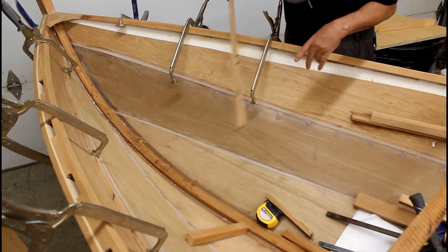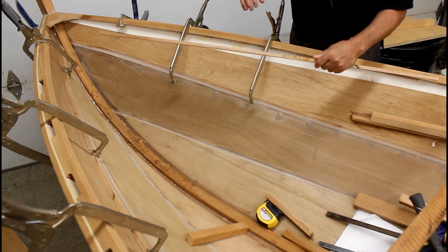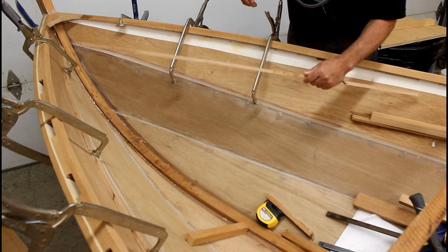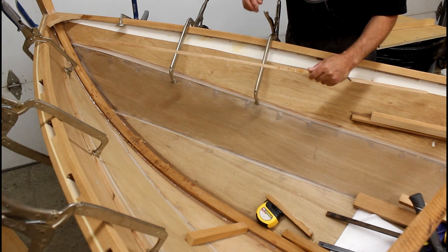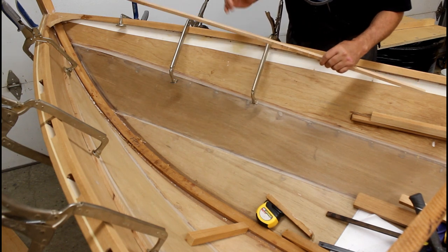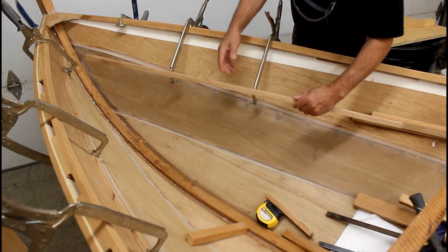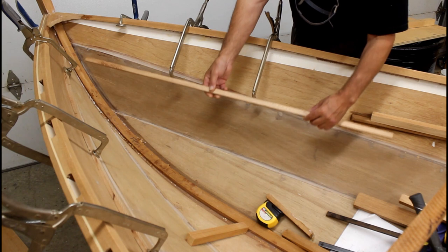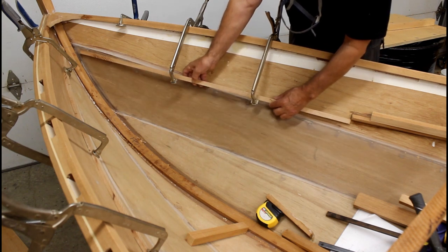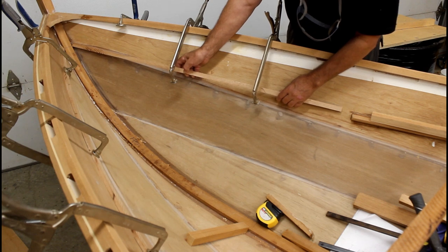This is the aft section. We'll also do it in the fore section. So we need to put a cleat in and then build some structure with some beams across, and then it will be covered in plywood. So the plans do show this option, and it asks for a 3/8 by 5/8 cleat in here, or call it a little riser.